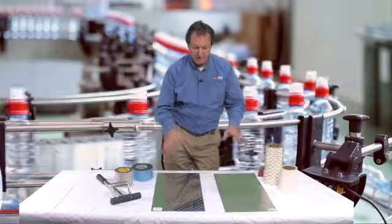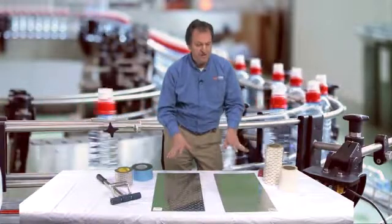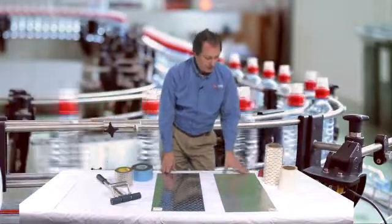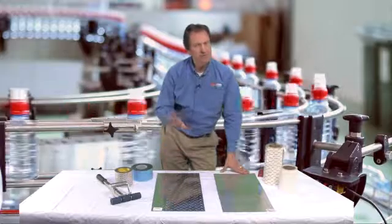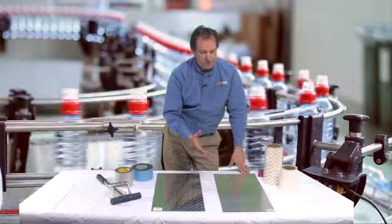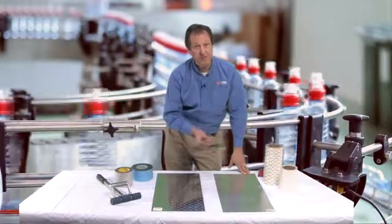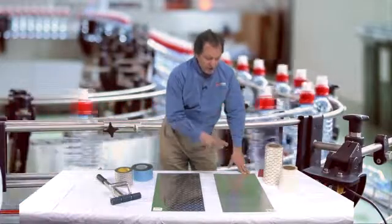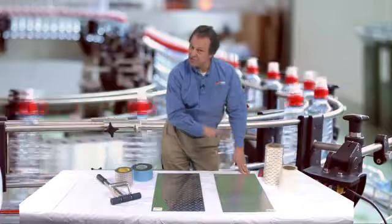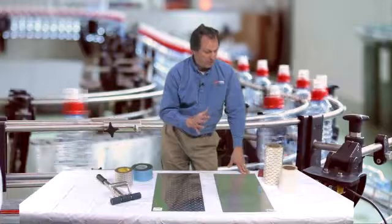What we're looking at here are a couple of very, very textured substrates, but also very different substrates in the sense of the amount of texture we're going to be dealing with. Now, if we're dealing with a metal substrate, pressure-sensitive systems really like metal, so you're going to have to make a determination if you think a pressure-sensitive system or an epoxy system may be more appropriate. There are some pressure-sensitive systems that can work with some textured substrates, but you have to be able to identify which adhesive system is going to be most appropriate.